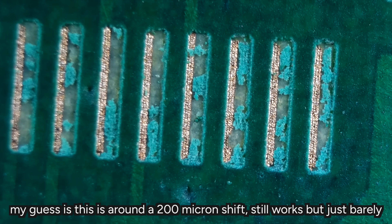I think I can also open up the solder mask pads a little bit, so that even if there's some shift, it's not going to completely cover the pad. This matters a lot less if you're doing really large parts, but I have a 0.5mm pitch TQFP microcontroller on here — it's gonna matter, it's gonna show up if I have it not aligned perfectly.